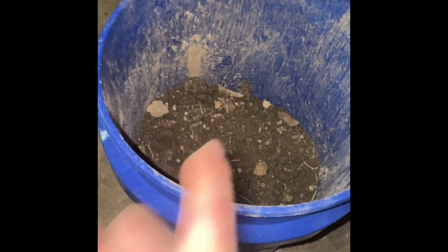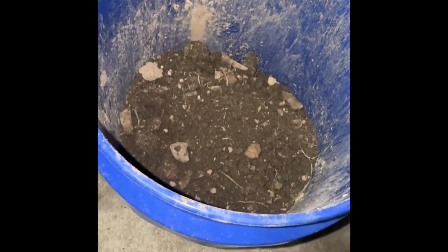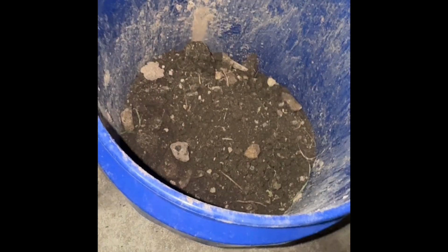When you get your soil, you're going to need a moisture content on it to do your one point. You can get this either by using your nuke gauge to test it in situ, or using a field oven to get that.